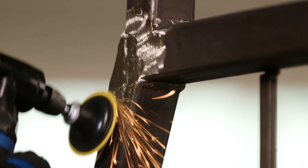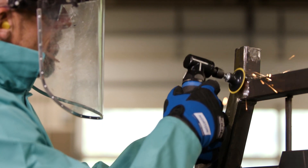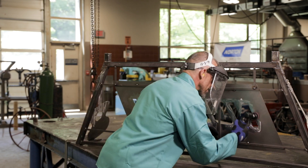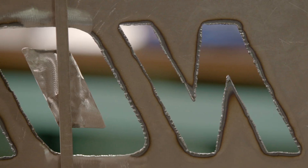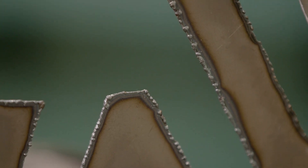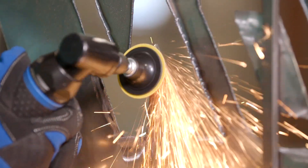That sanding process may take anywhere from 15 minutes to a half an hour. With this size of abrasive wheel on this roof rack, probably a half an hour, because there's some grinding and on the back of these letters where you've cut there's going to be some slag. The size of this wheel and the speed will take a little bit of time, but you can get some finesse with the angle grinder.